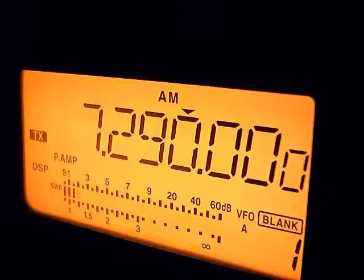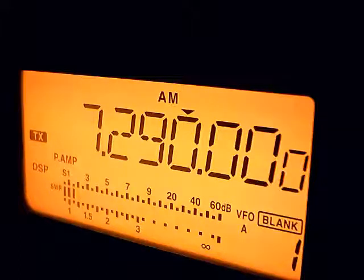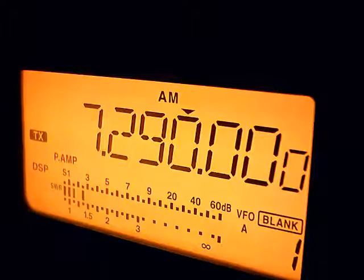Enjoy that vacation. And yeah, let's see. I had one other thing for you there, and I temporarily put it in the wrong file folder, Kevin. But yeah, I think 20 watts of carrier, and then make sure your modulation is low enough so you don't trigger your ALC. Don't want to hit your audio too hard with that 570 there. I found out on this rig here, you've got to back the mic gain way down. And Roger on the D104 into the Drake there. That's a good radio in your Studio B.